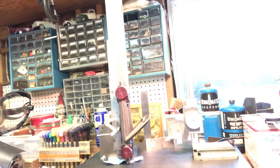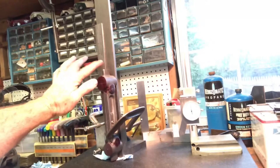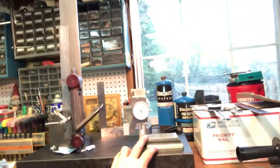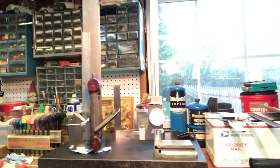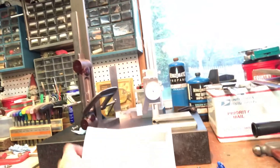This is my little contraption — I don't have a bigger angle plate, so I used this one and clamped a piece of cold rolled steel bar to it and a ruler, then clamped the piece to it and squared it up vertically. I had already marked the center part here, and I used that as my zero and set my vernier scribing block. This is the first time I've ever used one in ten years of metalworking, but it worked great.